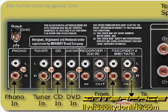The line-level inputs on this amplifier are labeled tuner, CD, and DVD. However, any line-level device can be plugged in here, from an iPod to the output from a tape deck. This amplifier has two tape loops. They're referred to as tape loops because a signal can be sent to a tape recorder, CD-R, or mini-disc recorder and monitored through the machine as it comes back to the amplifier. The input from a tape loop is used to listen to the tape.